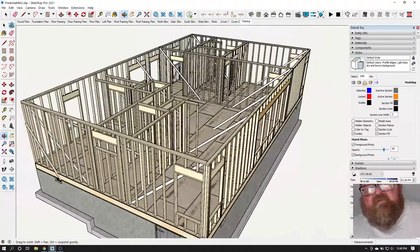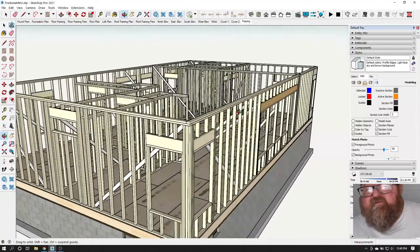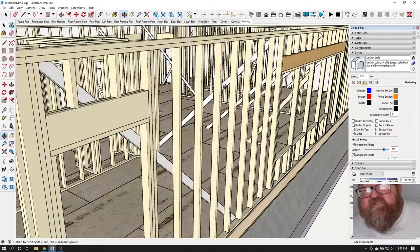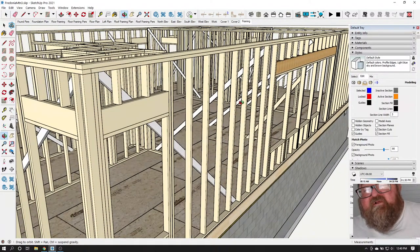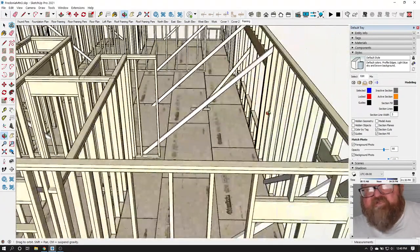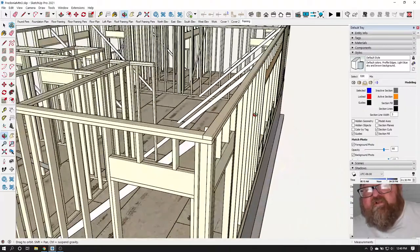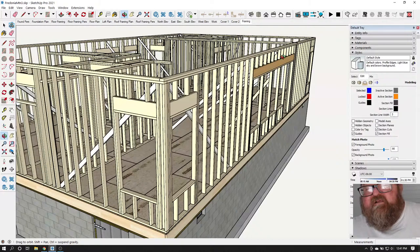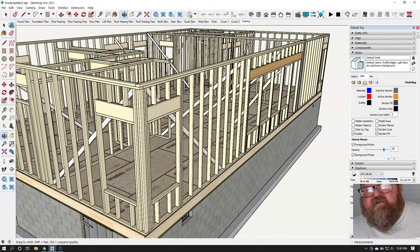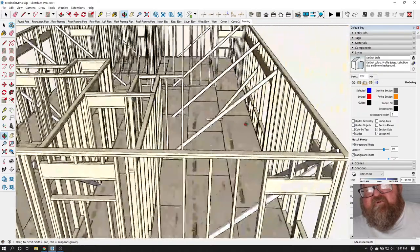We deal with this all the time. If I get these corners perfectly plumb and these walls perfectly straight, I still have to deal with the quality of materials, because this stud — stud grade — a stud grade two-by-four is supposed to be straight. But sometimes you'll have one bowing in and one bowing out. By installing your sheeting properly, that can help straighten up the wall — when you nail a bowed stud here and here, it'll help push it in. Same thing with drywall, but you really shouldn't have to rely on your drywall to straighten the wall.